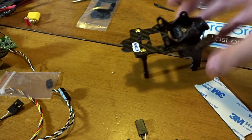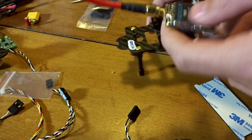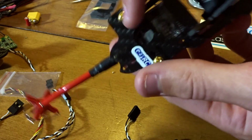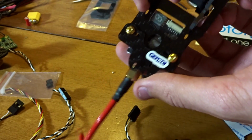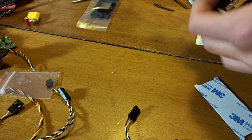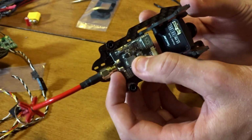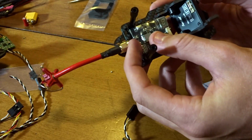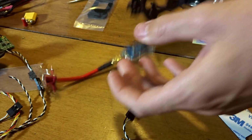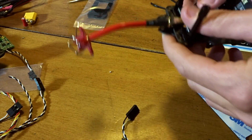And then the video transmitter, because of the way I'm going to want it with the button, it's not going to work. If I put the screen up, the button will get hit. It's supposed to show through these things, the little screen down here, but I'm going to put it upside down because I don't fly with anybody anyways, so I don't need to change the channel. And it should fit in here. Sorry for being out of shot. It should fit in here just like this with, once again, a little more foam tape on these little rails here, and then a zip tie through these two holes right here and here. Should fit like that, and the antenna should come out the back.